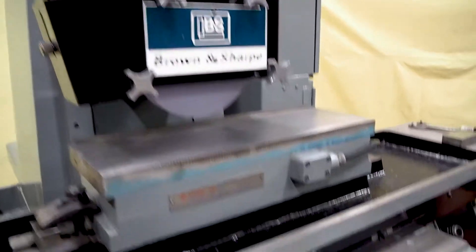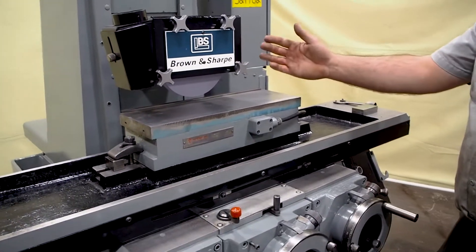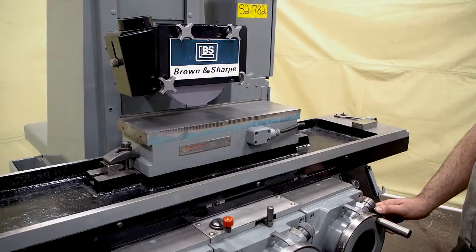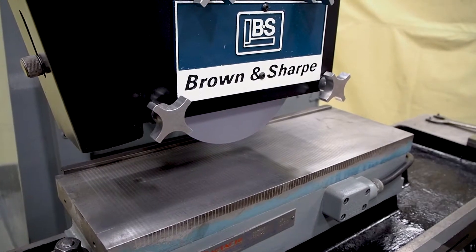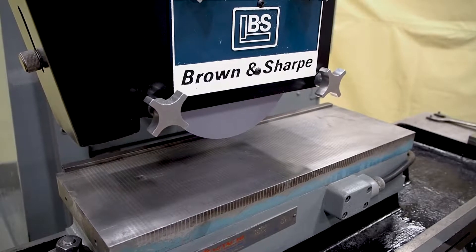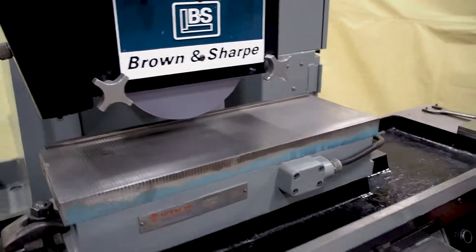I'll show you the true feature. Bring this switch all the way to the left for true — you'll see it slowly coming forward. This is how you true up your stone. Then go to neutral, reverse, and you can true in reverse also.